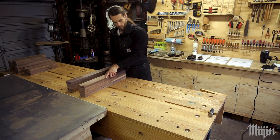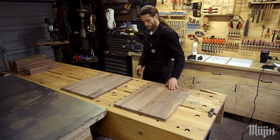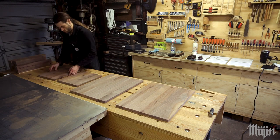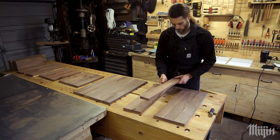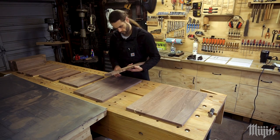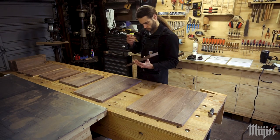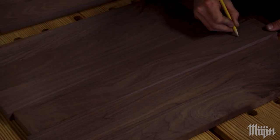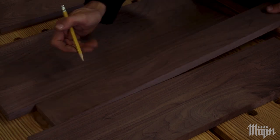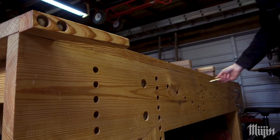Since I took in a bunch of stray wood from off the street, I don't exactly get pick of the litter here. What I traded in cost, I lost in quality, so some compromises must be made in the arrangement process, which is really about hiding less than desirable surfaces, like these blonde sapwood streaks and knots. Grain orientation is also taken into consideration. No judgment, of course. This gets marked up so all the grain is facing the same direction as much as possible.